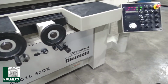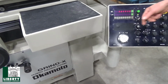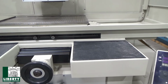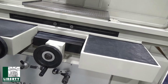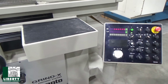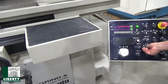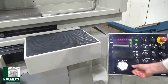So I'm going to turn off spindle just to turn on oil. Bring oil up, which brings our control ready. And before I do anything, I'll just give the table a direction. I don't know where I'm at on speed. Set the speed right away, which is good. We got everything in real tight on the dogs, just so we can get through a cycle in rapid movement here. In manual, I can work this guy here, incremental, 1,000, 1/10, whatever we want, 100 thousandths. It doesn't matter where we're at.